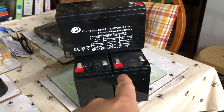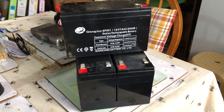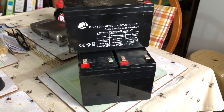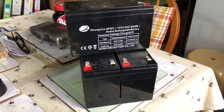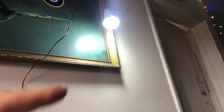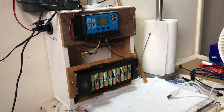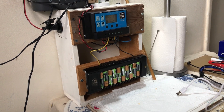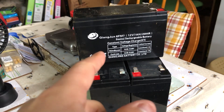Before, the box had three sealed lead-acid batteries in it — these ones right here. These were old secondhand ones out of an old cordless lawnmower, so they were not very good batteries and they have given up the ghost a bit. I took these out because when I had it running the light up there — a 5 watt LED light bulb — the voltage went down to about 10-point-something volts.